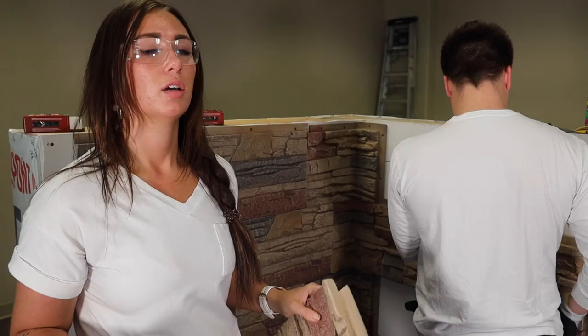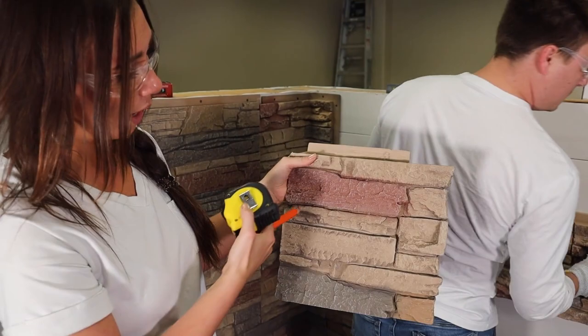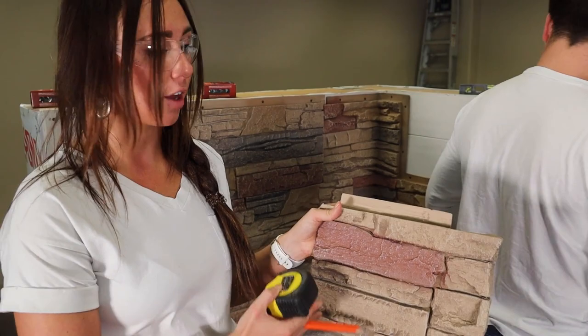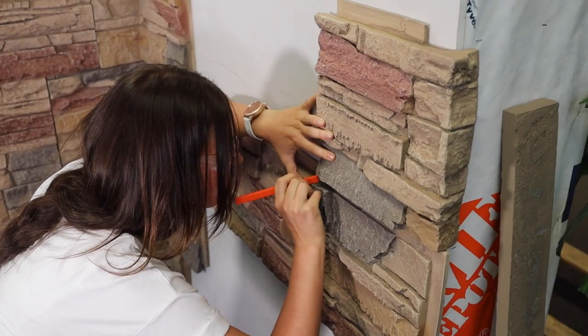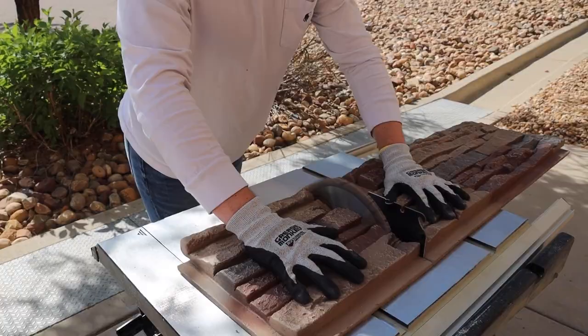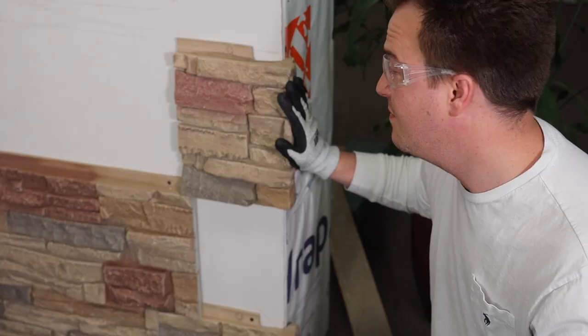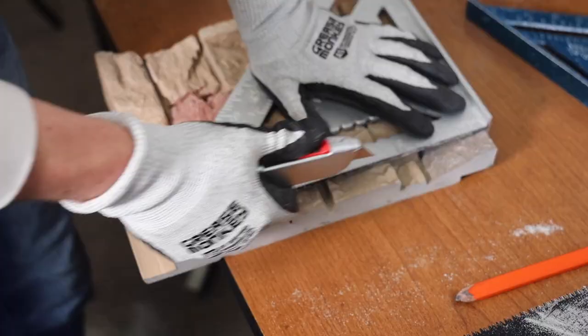We are going to be using our return pieces at the edge of this wall — those are our finished edge pieces. They come in the standard size of 12 by 12. Since these are not pre-staggered, you want to stagger every other row. In this instance we're going to cut off about three or four inches so that they're staggered. The return piece I have here — the reason I have it marked and scored is to recreate that shiplap area so I can make sure these panels fit nice and tightly together.